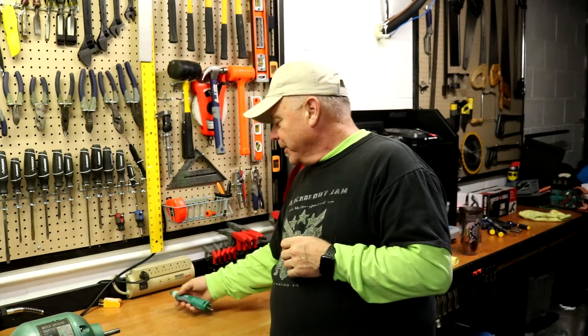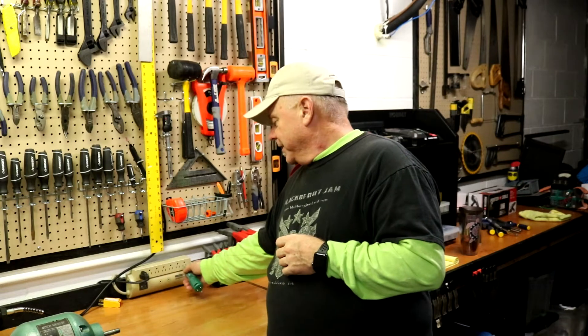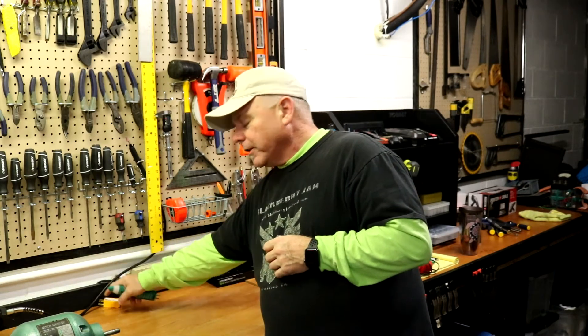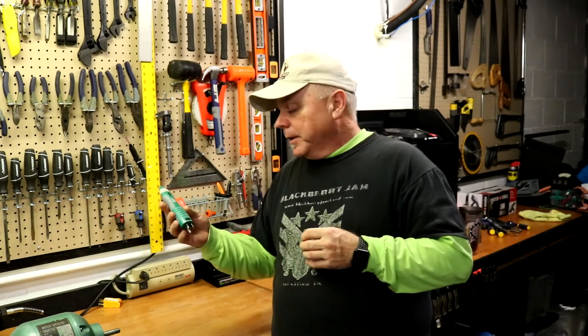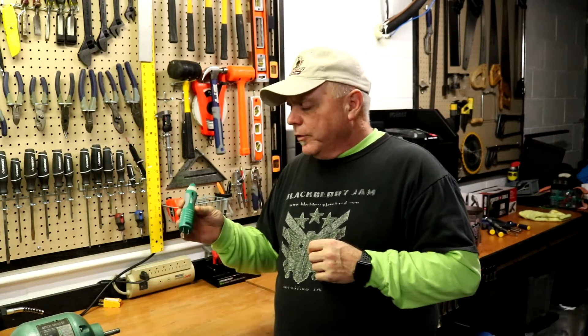But we know there's power getting to the switch. So let's come over here to the switch — no power over here, but there's power where it's fed by this white wire. I got this one at Home Depot. You can get them in electrical supply houses, big box stores, hardware stores. These run from 10 to 30 bucks — this is a good one, costs 25 bucks.